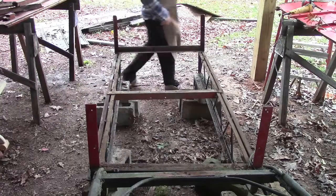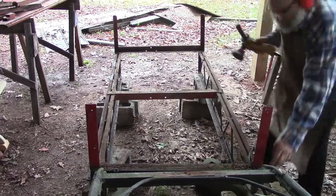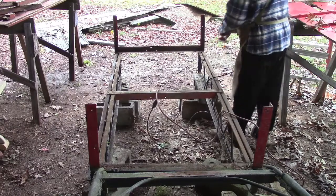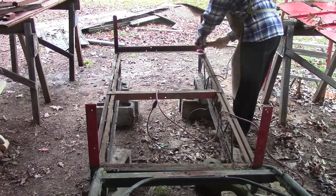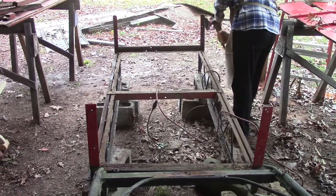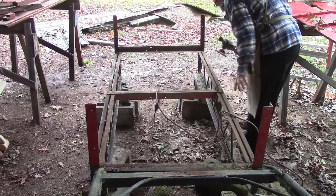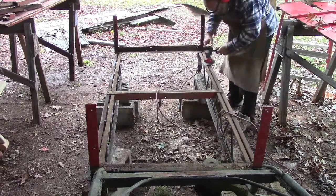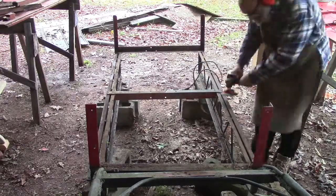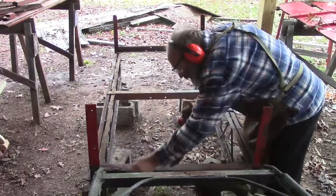As you can see here, I've removed all the wood. I've taken the angle grinder and cut off the carriage head bolts, and now I've got a cup-shaped wire wheel — it will take several minutes here. I went over this thing pretty good, all directions, all sides, took it in the shop, turned it upside down, did the bottoms and every side with this wire wheel. We're trying to get all the rust off that we can, the loose paint, the dirt, any kind of debris — it really messes you up.